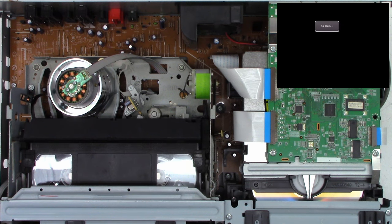Now, sometimes I'll go ahead and I'll press with my thumbnail. See, there's two little mounting tabs, so I'll press down with my thumbnail and then very gently lift up just a little bit on the contacts to give them just a tiny bit more tension, as the case may be. I'm going to add just a bit of dielectric grease to the contacts.